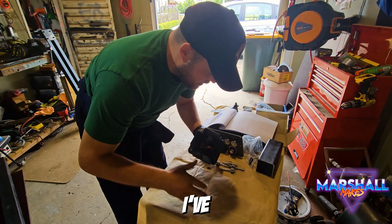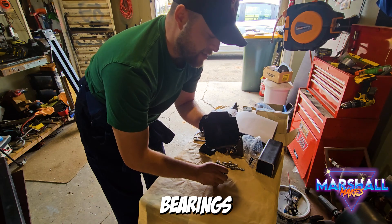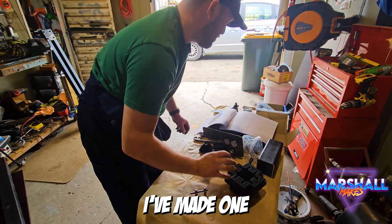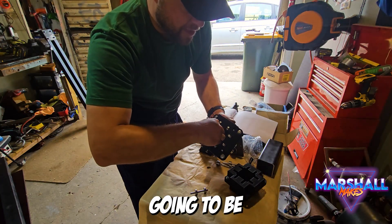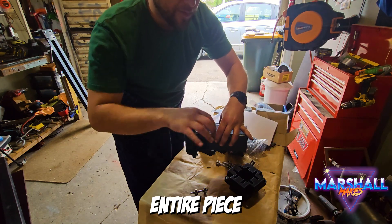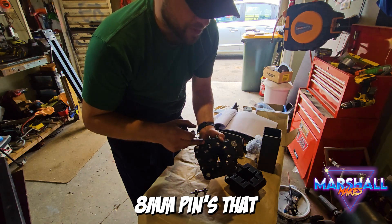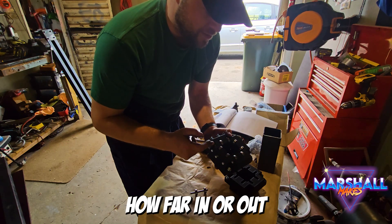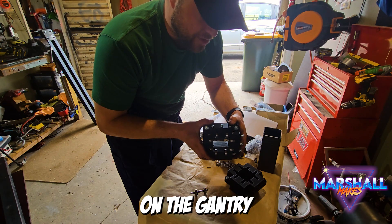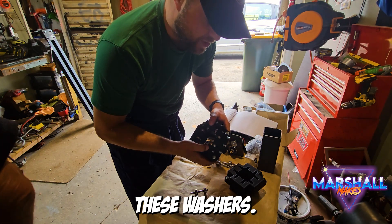While the old man drills that, I've got these 3D printed parts. Inside here, where these bearings are going to slip - the fins go through - and they're also going to have grubs in the top. You're going to push it back and down so you make sure you've got a lot of tension on them. These are going to be the guides on the gantry, and this is what's going to slide across the entire piece with the arm up here. It's going to have 8 bearings in each of them, with washers on each side, and these 8 pins that go through. These here are going to determine how far in or out that pin is going to be - it pushes down on it so it doesn't have any movement when it's on the gantry, because you can't have any movement otherwise your torch is going to be bouncing up and down.